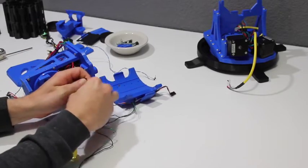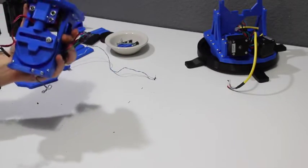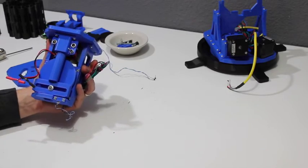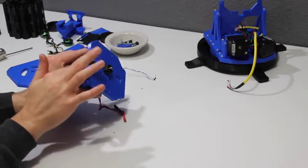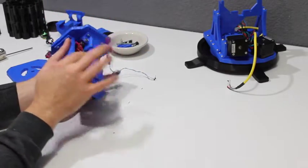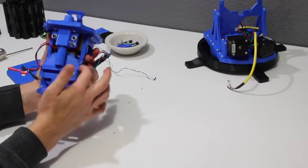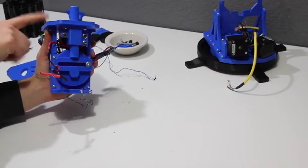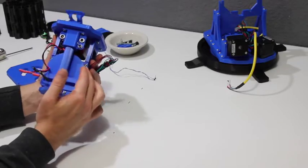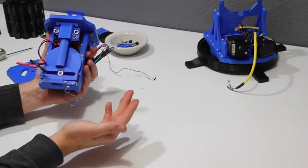The FDL-1 is made up of two things: you have your flywheels up front that spin real fast, and then in the back you have one stepper motor that is directly attached to the revolver — it turns the revolver in precise increments. And then there's another motor that turns and pushes this plunger forward and back. There is also a micro switch similar to the flap on the side of the revolver, except this one tells the FDL-1 when the plunger is all the way back. Steppers are very precise, but it also helps to have a stopper switch to check in on their position every once in a while.